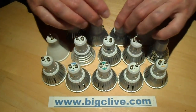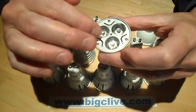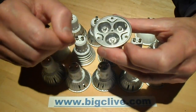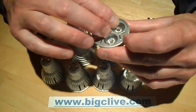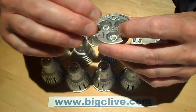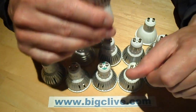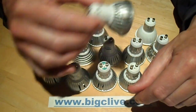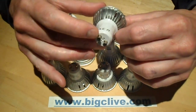Now we get to the hydroponic lamps. Hydroponic lamps have 3 chips in this standard 3W type package — two of the chips are red and one is blue. They're supposed to be 660nm red, but I'm not convinced about that; I think they're using 650 or 635nm red because it just looks a wee bit too cheery and bright, since traditional 660nm red is quite a deep red. Not too accurate with the colours, and not all that accurate with wattage either. They claim 6W — special Chinese fantasy watts — actual power: 2W. This one was also rated 6W and came close to an ordinary 3W light at 3W.